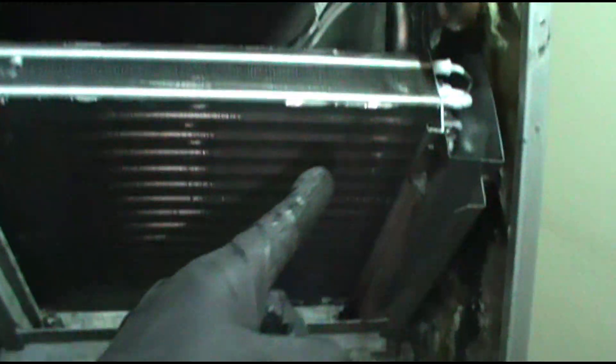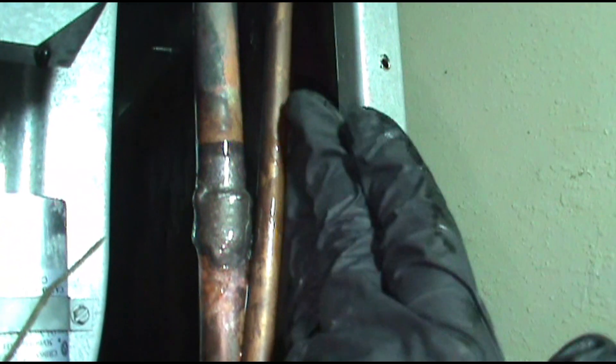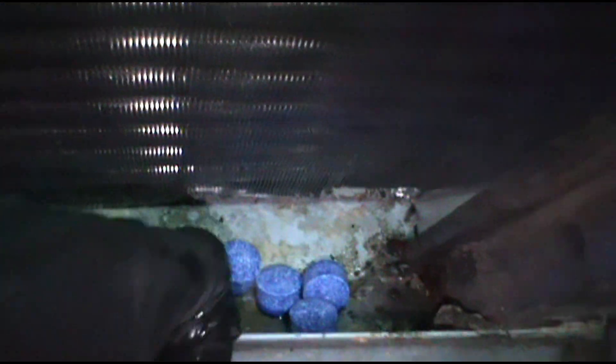And there's the new coil. There's my braze - it's pretty tight, just do what you can do. This is the bubbles check - no bubbles, no troubles. Didn't see any bubbles. But look how it came a little dinged up from Goodman. I put some tabs in the drain. But this is the new one and I'm about to release the nitrogen and put it all back together.